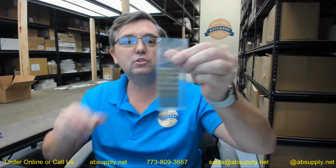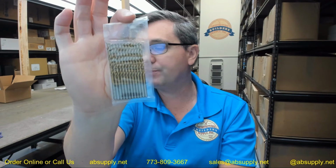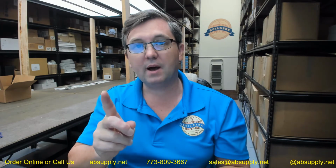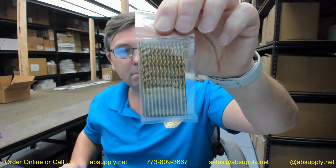I am personally not necessarily a fan of titanium nitride, although my job doesn't allow me to explore the world of drill bits as much. I like black oxide. They're cheap, and I use the tool as maturely as I can so that I'm not tearing it up. Although there are times when I will purchase just simply the best quality bit available because the job I'm doing I know is a one-time possibility. I don't get a second chance. I'm going to discard the tools when I'm done, and titanium or cobalt would be something certainly up my alley at that point.